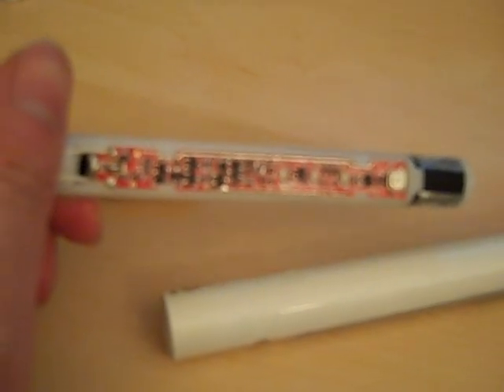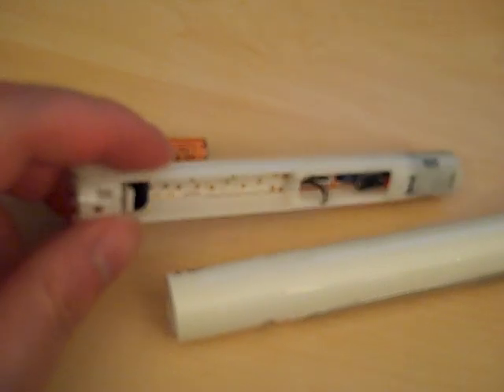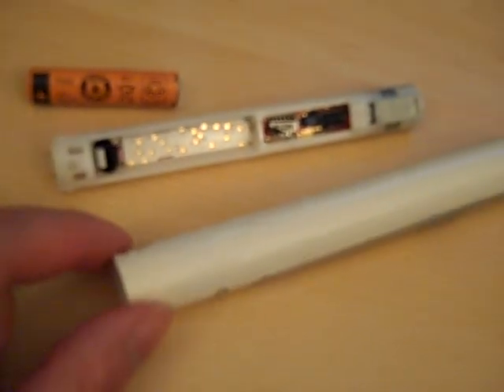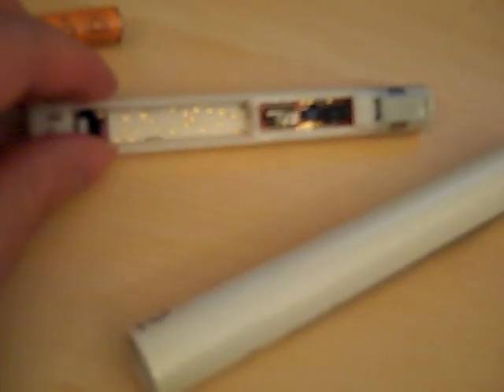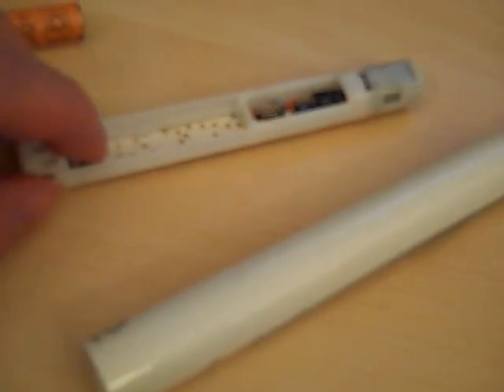Which is quite annoying. So that means somewhere on this board, the thing that's supposed to control and stop charging once it's full is somehow not working. And once you open this up, it's not quite as waterproof anymore. The battery is kind of soldered on, so if you do use a AAA battery, you have to desolder it and solder it back on every time, or put a rechargeable AAA battery in. It gets quite annoying, and it literally loses its whole waterproof charm.